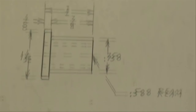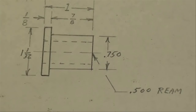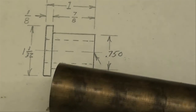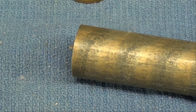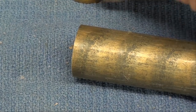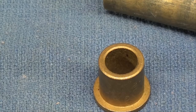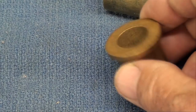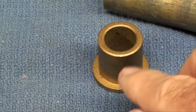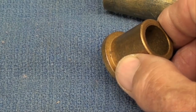Watch the different steps I take in order to do this — some of these should be done in the sequence I show you, although you can vary a little. Do not start by cutting your stock to length. I always like to start with a larger piece that I can put into the 3-jaw chuck, and the very last thing I will do is cut it off to length. Operations we'll perform are: turning to a shoulder, facing, center drilling, drilling, reaming, and cutting off. We've got nice chamfers which is the bevel — that makes it look finished.